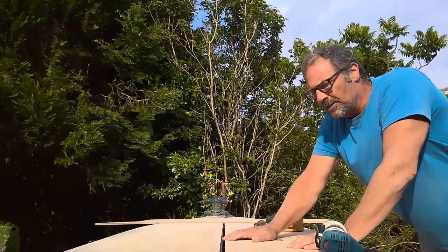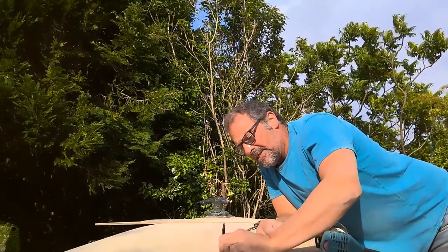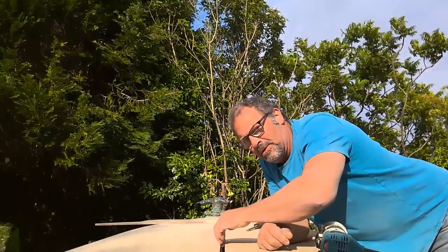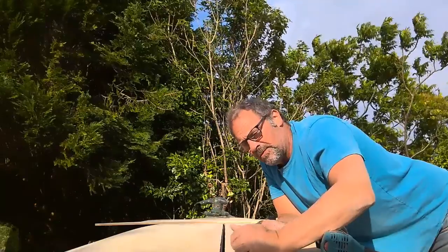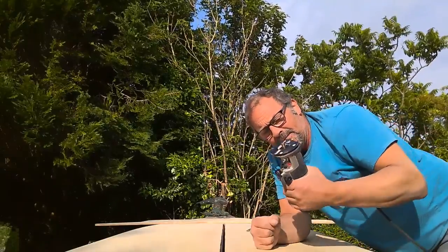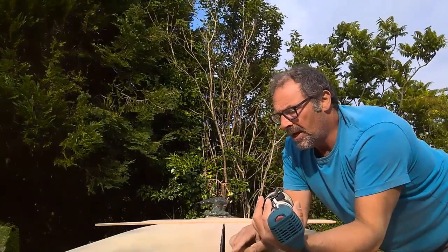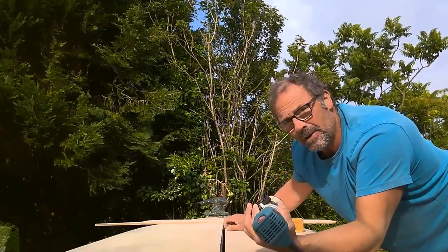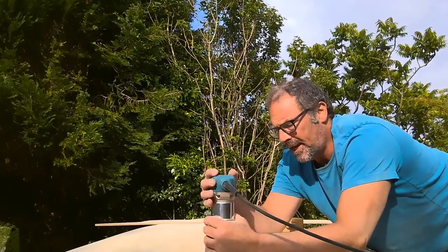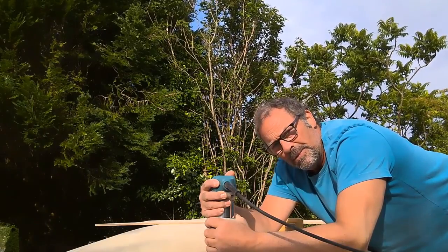This is the centreboard slot, and when I flipped the boat over and looked into it, I see the centreboard case bottom edge visible in the slot, but the other side is not visible because there's an overhang of the bottom board. So I have today taken this wonderful tool, which is a router trimmer with a cutting blade. I drew a 2mm line away from the edge and put this tool into the slot and very carefully cut away about 2mm of the bottom board.